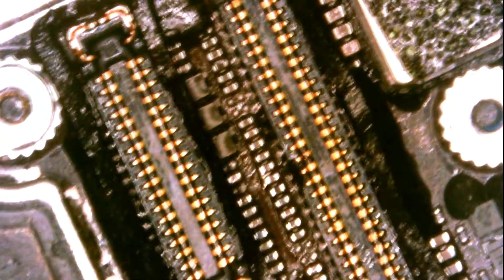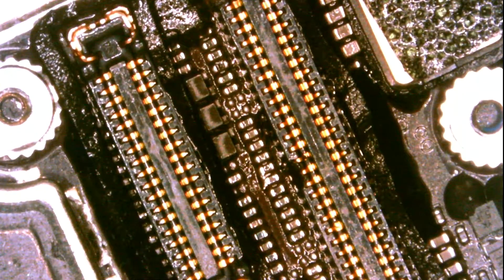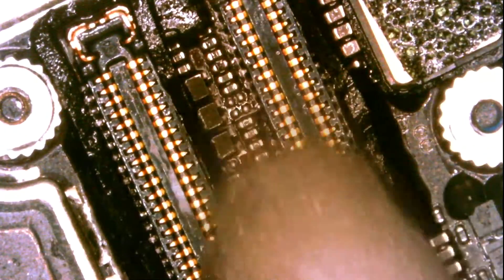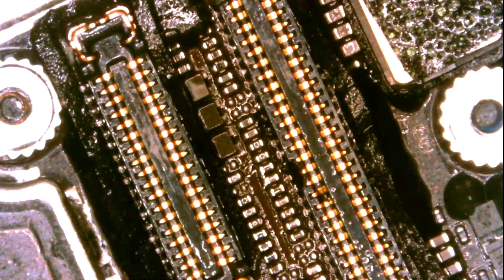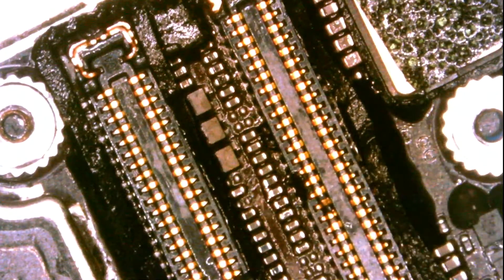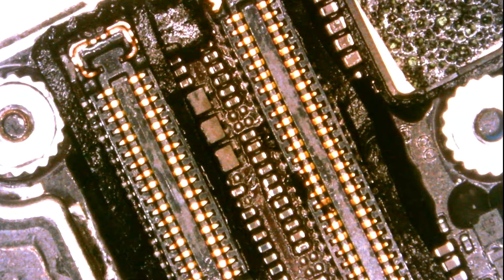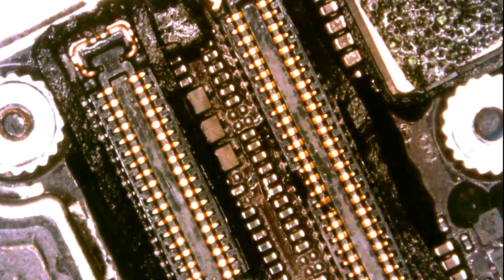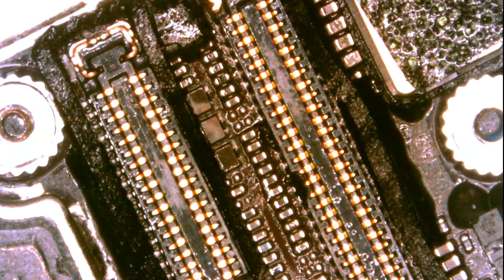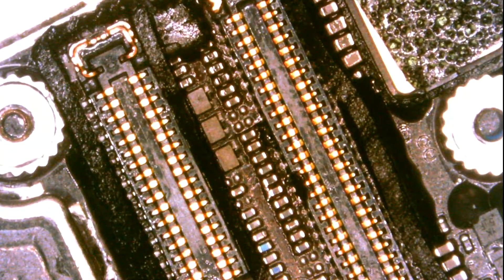As you can see, we touched the plastic on the FPC connector. That's okay, because it's extremely difficult not to touch it — the components are very, very close to the connector. You see a tiny gap between the components and the connector, but in reality the components are almost touching. Under the microscope it looks a little bit further away. Unfortunately, we are using extremely fine solder tips, and sometimes it's unavoidable to touch the plastic on the FPC connector. That's not a problem.